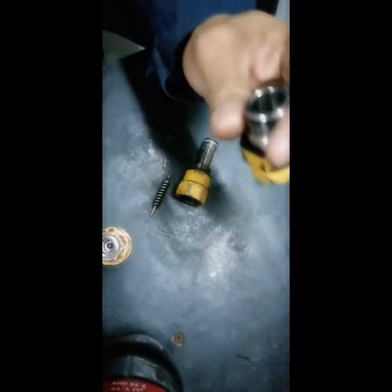The broken o-ring pieces were staying inside together with the cup. So I replaced it with a new one. After the replacement of the o-ring, I put it back, fixed it, and then installed the needle and spring and closed it back up.